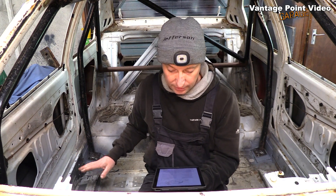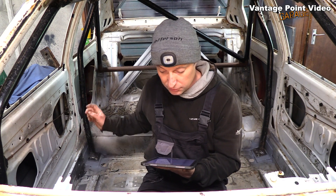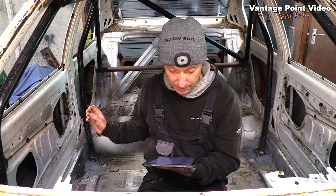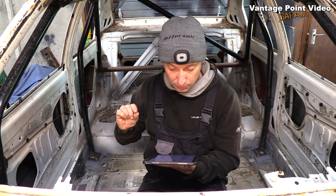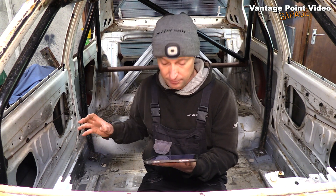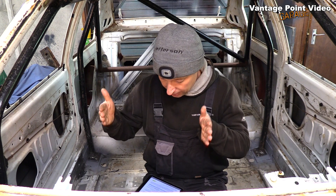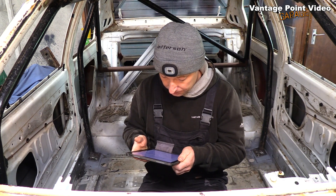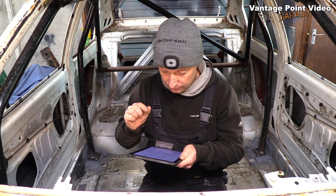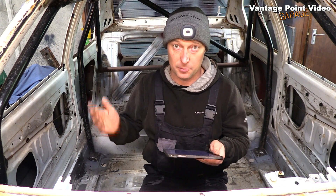The principle of the mounting is basically a steel crossbar. You can use tube or box section — I've chosen box section. The minimum width is 35mm and the minimum steel thickness is 2.5mm. I've actually got 3mm thick and 40mm wide, so a little above spec. You need to put end plates on that, with a surface area of 40cm² and a minimum thickness of 3mm — the same thickness steel I've used for mounting the roll cage, so I'm working off the same sheet.